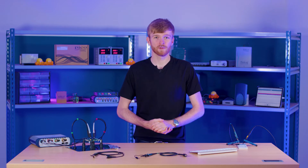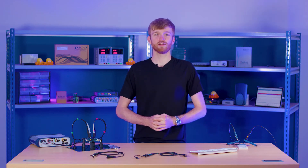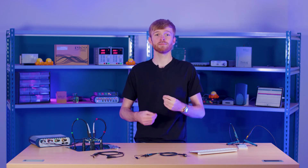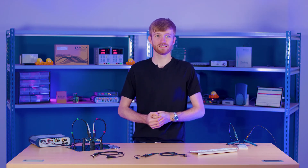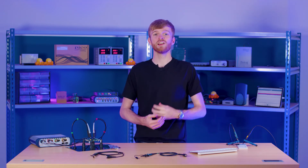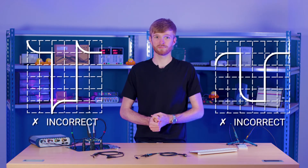Another way to get more accuracy out of your probe is to adjust the low frequency compensation of the probe using this little screw dial on top of the probe. This will help you match your probe to your oscilloscope by compensating for the difference between each scope's input capacitance compared to the probe itself. This is really important when working with high frequency signals, as the faster a signal is the more impedance there will be, making a nice square wave into a pointy or limp square wave. Some probes may have high frequency compensation built in and calibrated from factory, making life a little easier.